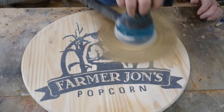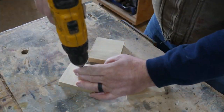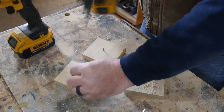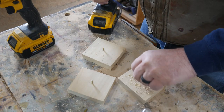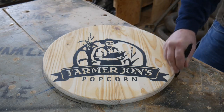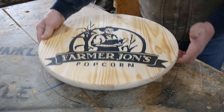Here's a little unorthodox way of sanding — we'll use the orbital with a full piece of paper. For the finer grits we'll just use hand movement. Now here's another thing I do a lot of times because I don't have any of those fancy hockey puck project holders: run a screw straight through a block so the screw is sticking up — it creates a point. You'll do it on three of these. Draw a circle on your bench as an indicator of where those blocks need to go. It holds your project up off the table so you can apply the finish.